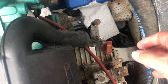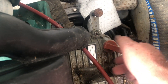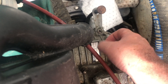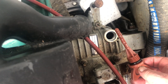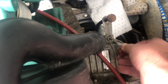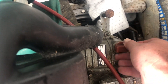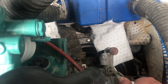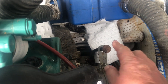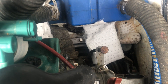It also pays to check the sail drive oil, which is exactly the same as the engine oil. Now that's fine. And to change it — if it's out of the water you can just undo the drain at the bottom of the sail drive; otherwise you can stick your tube down through here and suck it out just like the engine.